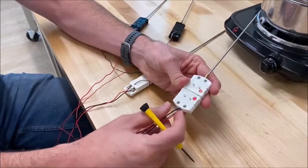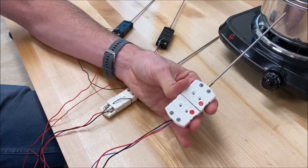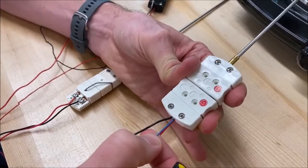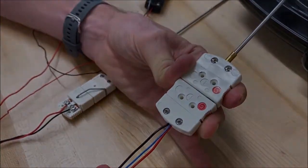When we look at our RTD, we have a three-wire measurement. We have our positive and negative leads just as before, but we have a third wire that is in place simply for lead wire compensation to account for any resistance in the wiring itself.